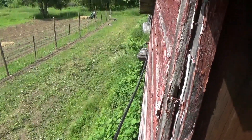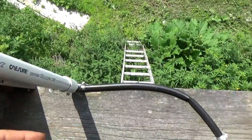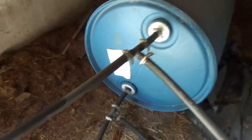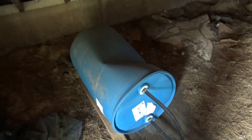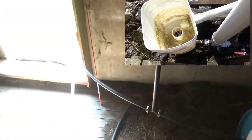Here we are at the top of the barn. That's the overflow line going out — it runs along the roofline to the pool. This is the main water line, both input from the ram pump and output to the valving system and all other output fittings. That input comes up into here into the two 55-gallon drums. I just had to put this tee in here — it breaks the airlock and lets air directly in when we draw demand off the barrels, so we don't collapse the barrels and lose good flow. Collapsing barrels will eventually put a kink in them, give you a pinhole, and then you've got a leak.